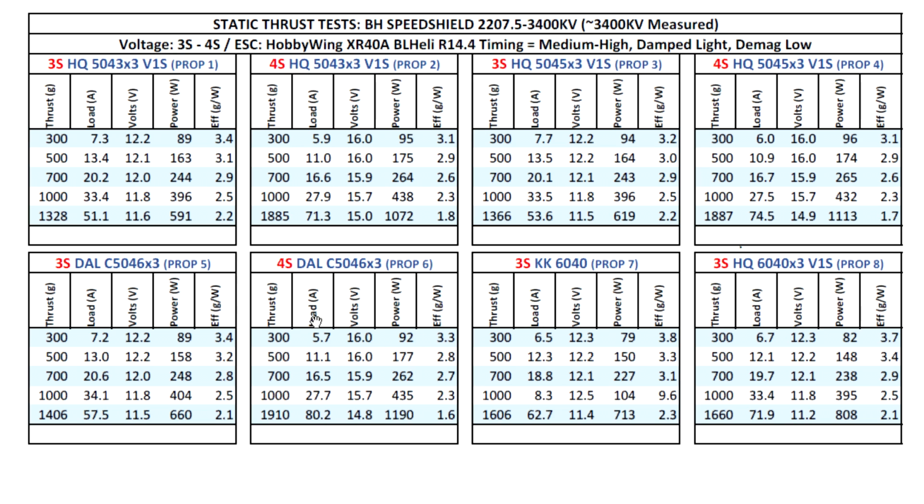When we're on the thrust stand in static conditions, that's where the motors hit the wall, basically, especially at this high kV. As you can see here, the increase is not a lot, and the amps just keep increasing, and the thrust increase is just marginal. So that seems to be hitting the wall right there as far as making power. But again, like I said, once you're in the air, the props are going to be unloaded, so the higher pitch, slightly more aggressive props are going to come into their own, and they're going to be able to push more air and spin faster, possibly.